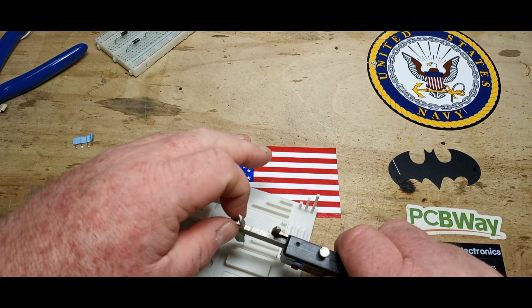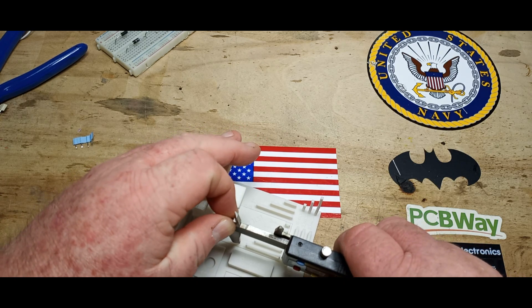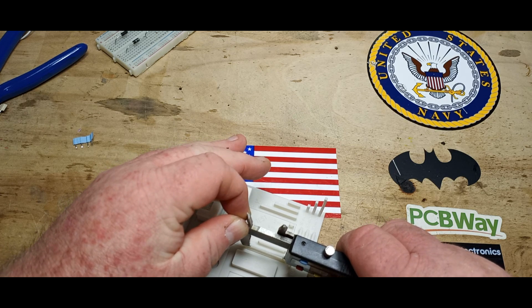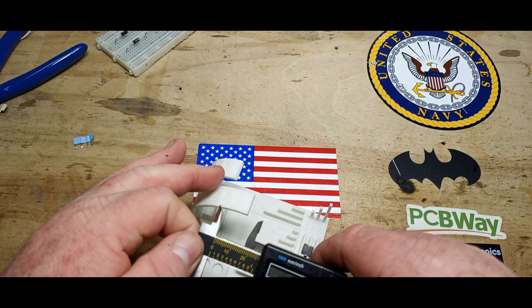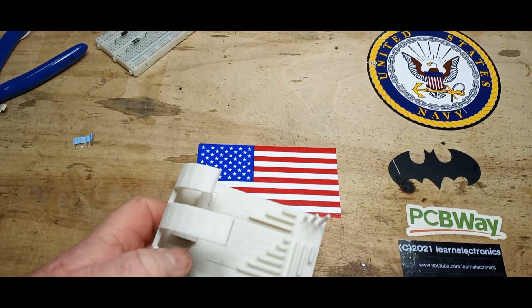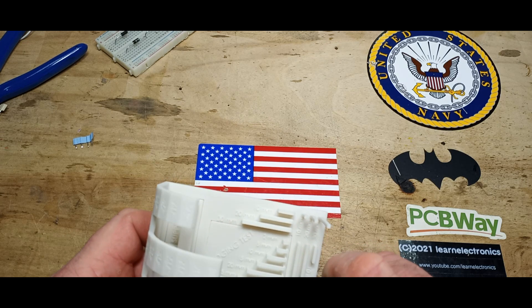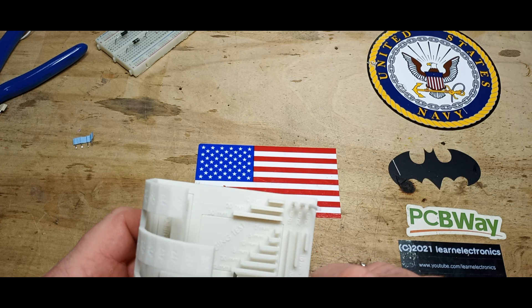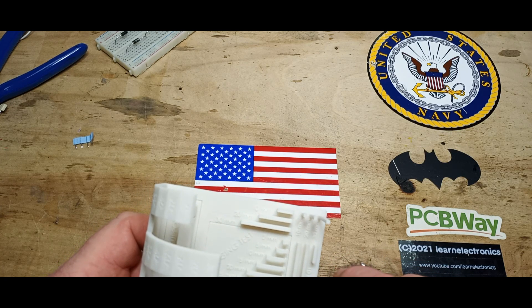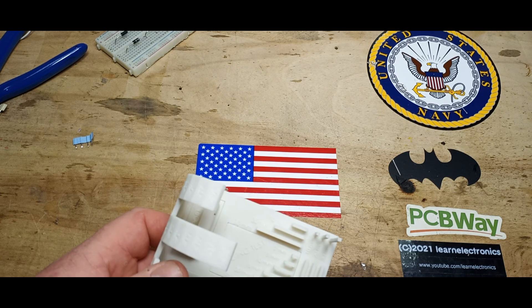Now let's take a look at these. First one should be 25 millimeters — that overhang is kind of messing me up — measuring 26.96. And 25 for the inside — yep, that's the inside diameter of those bridging tests — measuring 24.58. Not going to be able to get in there fully.